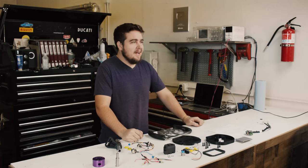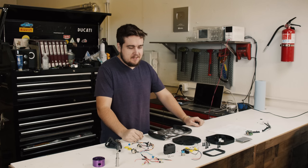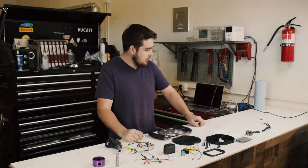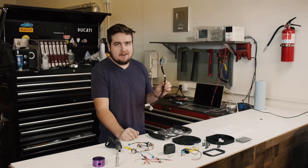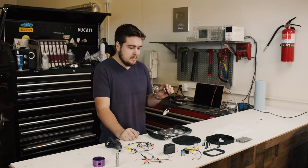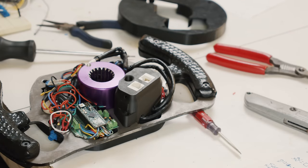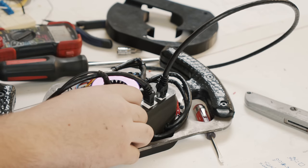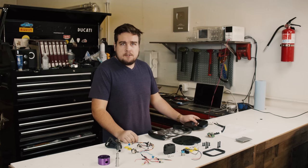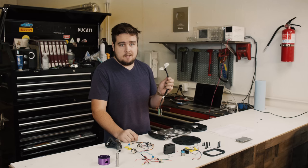Future Wesley here — I hated the spaghetti. It was a complete mess and was causing connectivity issues, and I hated the Molex plug. So what we have now is a circuit board. This is just mapped out on a breadboard — spaghetti on a smaller scale at this point. But it would be almost nothing to get a professional motherboard actually planned out and printed for this. Once I double-check this works and get everything assembled, I'll order a board and go from there. The most important part: instead of going with a Molex connector, you'll notice these have CAT6 receptacles at the end of them now.